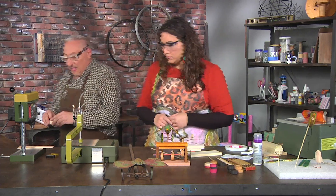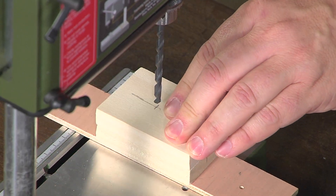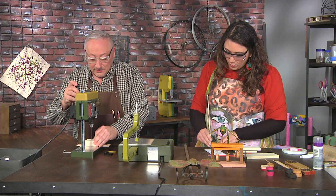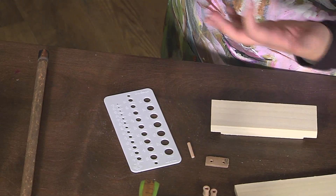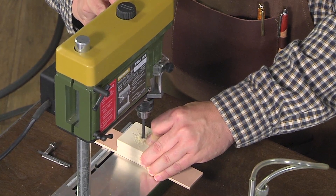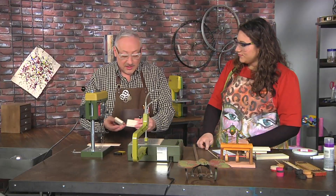I've already got this set up. You've chosen a bit that's the same size as the rod you're going to put in — just a little bit bigger, because you don't want it tight. There's a little gadget here to help you figure that out — basically a measuring tool to figure out which drill bit to use. It's my favorite tool and it's like a dollar. The simplest tools make the biggest difference. Going nice and slow, let the bit do the work. And let's see how we did. Flawless. Perfect.